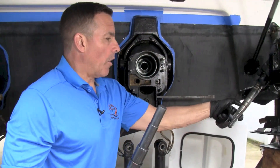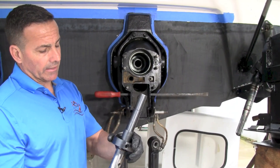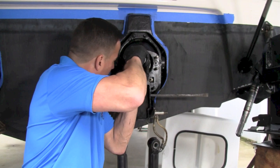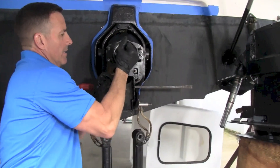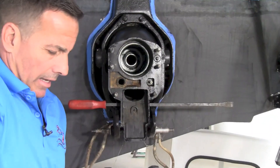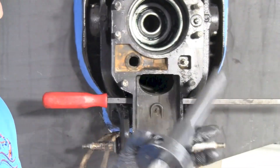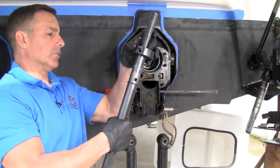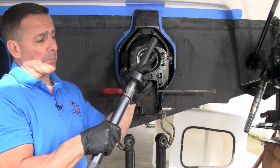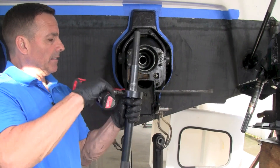So I took the O-ring from the drive shaft, slipped it over here, and now I'm going to put this on here like this — that's going to tell me where I'm going to drill this hole. What I would do is put it inside, push it straight in, making sure that the shaft is all lined up. When I pull it out, it's going to tell me where the hole's got to be. Then you're going to have to drill the hole. That's not an easy hole to drill, so you're going to have to really get a press or bring it to a machine shop. It was very hard for me to do — the bit broke in there and I had to take it to a machine shop.